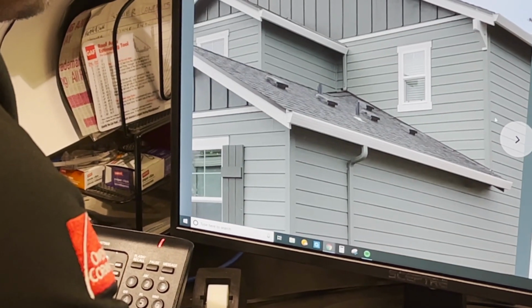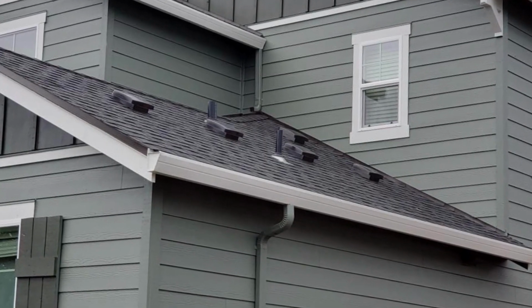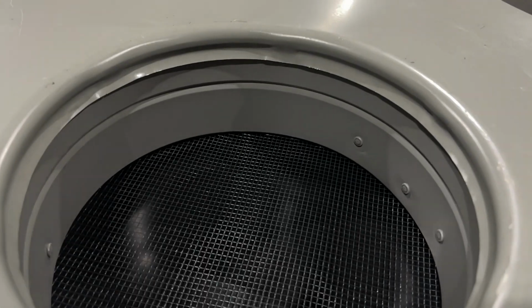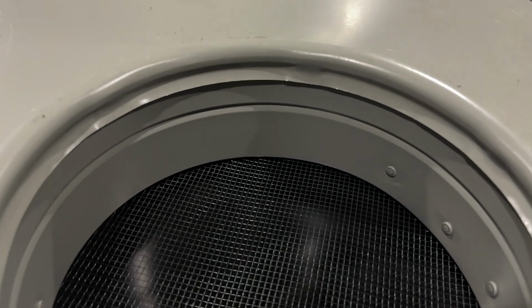So what the builder did was he added the AF50s for intake ventilation, which would work. Dominic said, hey, never had an issue before. Well, my friend, these are exhaust vents. They're made for exhaust for the roof. So now you have air sucking in through the bottom, right? And the snow's just going up and inside of them. Well, it doesn't do that for the exhaust because air's going out. So when it's intake, the snow is going inside of it and it's coming out.